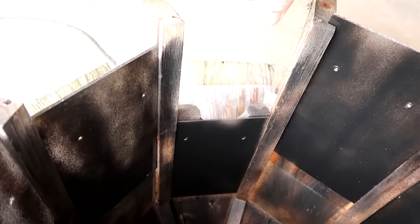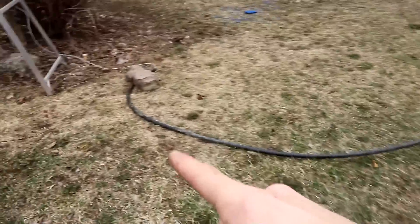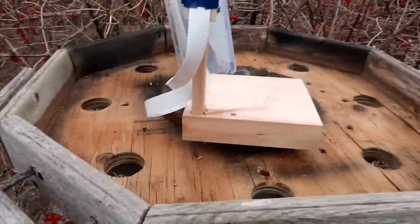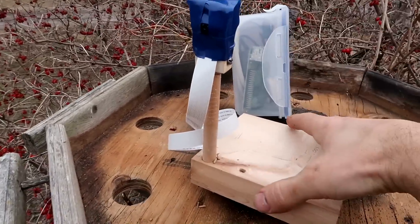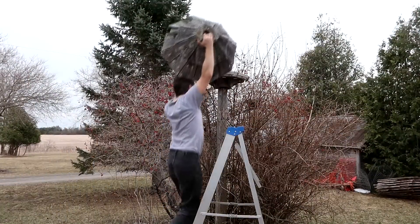These slide up and down, which will allow me to get in there and aim the camera. I ran the ethernet cable through some plastic hose so that hopefully it'll last longer when I bury it. It goes up to this post. Here I've got the computer and the camera module, and I just tested that from inside — it actually works. I just need to aim it this way a little bit more, and now I just need to put the top on.